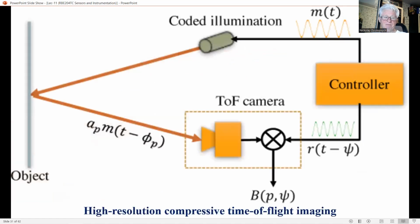Measuring the shape of very large objects can also be performed by optical ranging. Since the distances involved in such applications are much larger than in the previous example, triangulation is not a suitable technique. Ranging using optical TOF is a better option. Moreover, to keep the sensor dimension small, a feedback approach with tracking is recommended. An example of this combination, TOF and tracking.